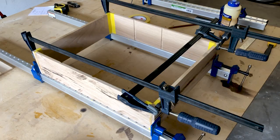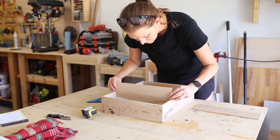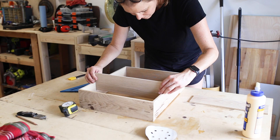The dark places you see on the outside are blade burn marks from the re-sawing. I never sanded them out because these faces are going to be hidden in the wall. With the frame glued up and dry, I moved on to inserting the shelves. I did a quick dry fit to double check that my shelves fit, and once confirmed, I laid down some glue in the grooves and slid the shelves in.